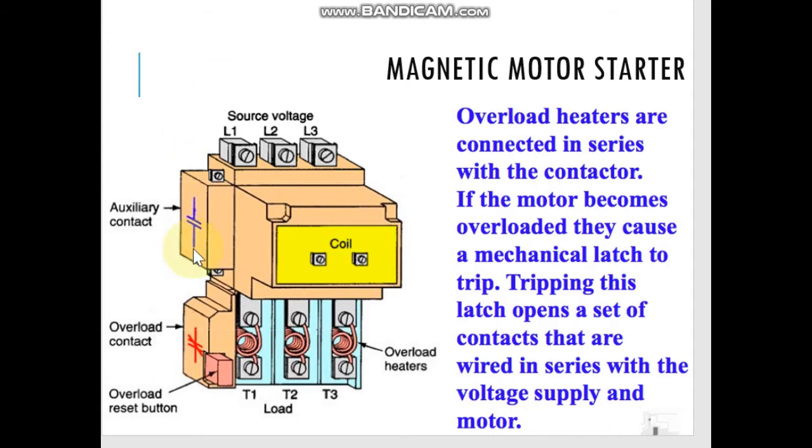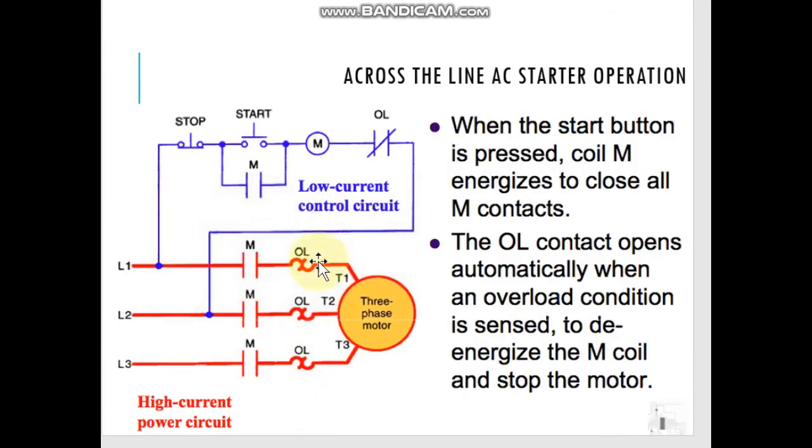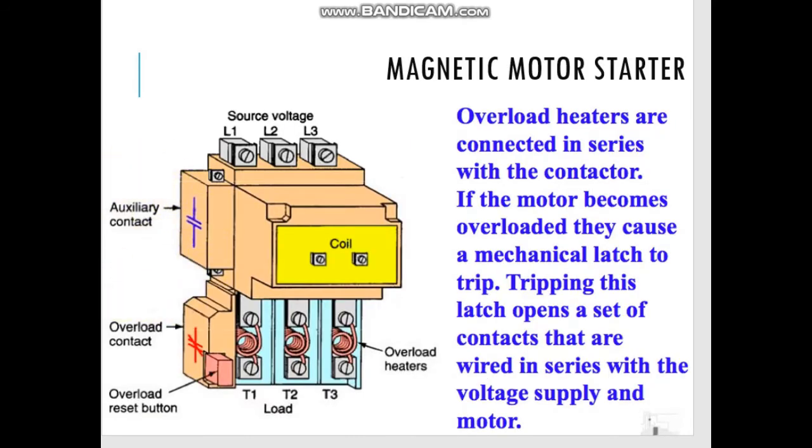When we look at the magnetic motor starter, we can see that there are overload contacts that take care of when an overload happens. It will break the circuit — break the circuitry — in the sense that these overload contacts break the power. We also have what we call the auxiliary contact, which performs control functions that are isolated from the power.